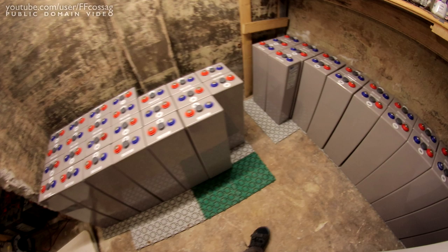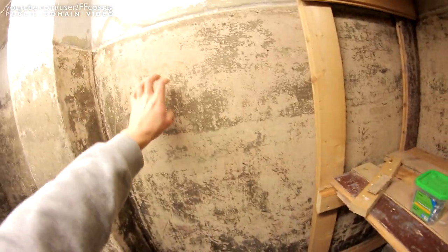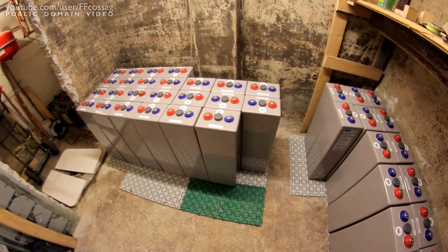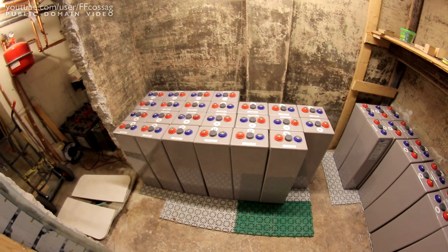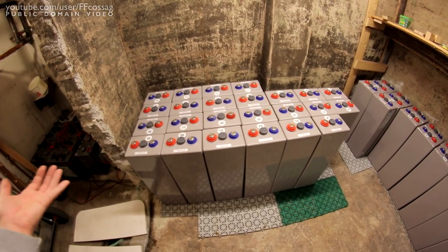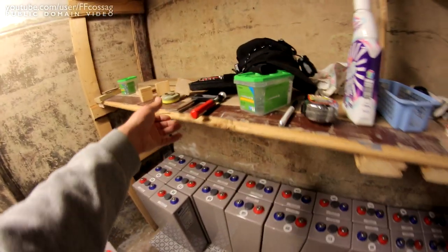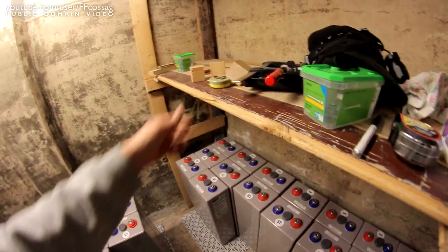This battery turned out a bit more bulky than I imagined. We still have a path to access the area where I'm intending the inverter to go, but it's a bit taller than I want. I could rearrange to stack those two cells. One issue is I'm going to have to cover these, as the battery circuits are going to be isolated from the mains on the inverter, and normal people come into this space. Everything needs to be tied down with wood or plastic to prevent accidentally touching it and dying — or dropping a metallic tool on there and waiting for the smoke to start billowing.